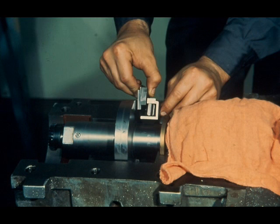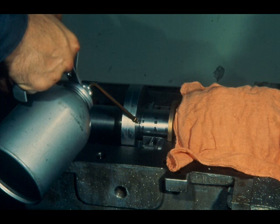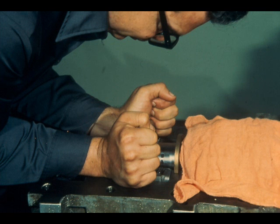With the lock nut properly tightened, our concern now is with runout of the thrust collar and the lock nut. The position of the pump rotating assembly is also of major importance at this point. The workman first installs the bottom half of the base ring of the active thrust bearing, which is the inboard bearing on this piece of equipment. Then he inserts three thrust shoes in the base ring and rotates this assembly to the bottom of the bearing housing. He then applies oil to the thrust collar and the thrust shoes while the shoes are not in firm contact with the thrust collar, so the oil may enter between the two.